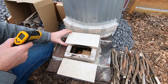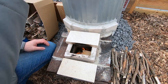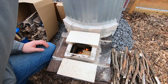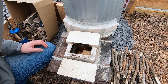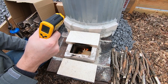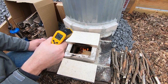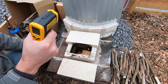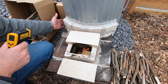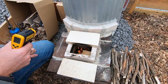Let's see where we're at with this fire going. We're at 280, 285 degrees up top. The bricks on top are at 144 degrees. The trash can on the side is at 300. Going down to the base at the ceramic, that's 175. So a big difference between the top and the bottom. Down at the very, very bottom I can actually touch it with my hand — it's not hot, but within an inch or so it gets really hot.